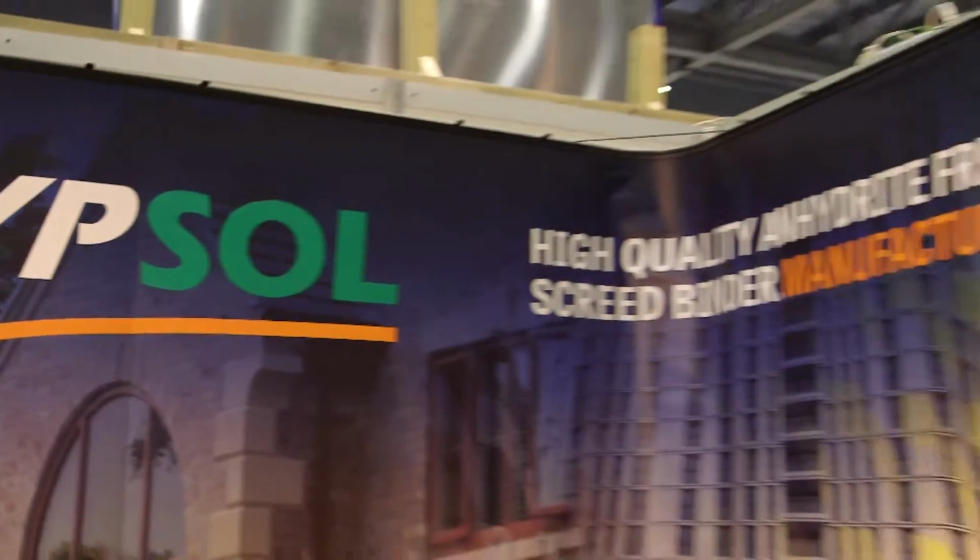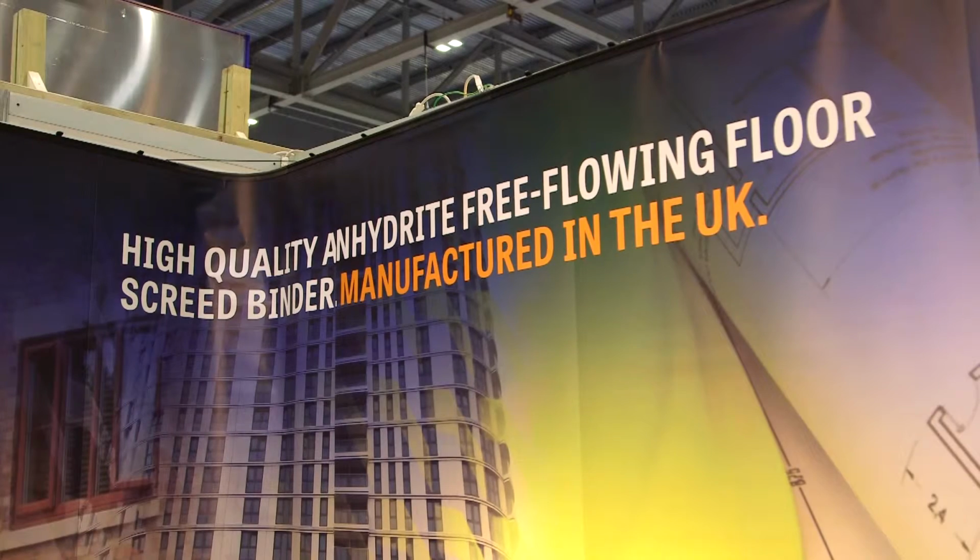In terms of its limitations, there are one or two areas that you wouldn't want to use it. For example, it's designed as a domestic or a foot traffic material, so light commercial and foot traffic, so you wouldn't put it in a factory floor, for example. You wouldn't put it into an application where it's outdoors. It's designed to take a subsequent floor covering, and it is designed for internal use only. So you can't build your patio using these types of materials.